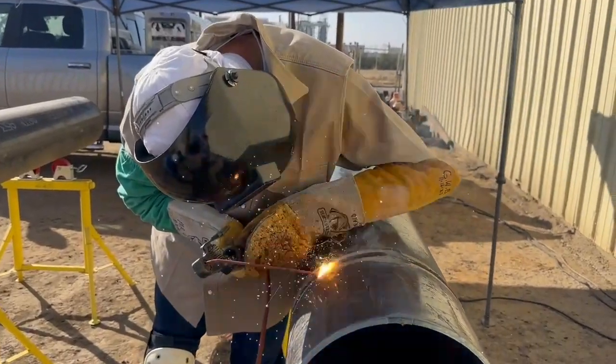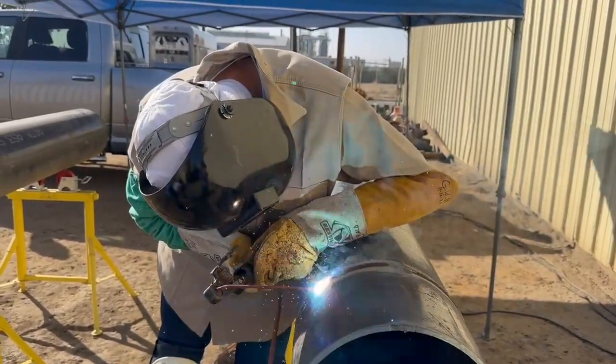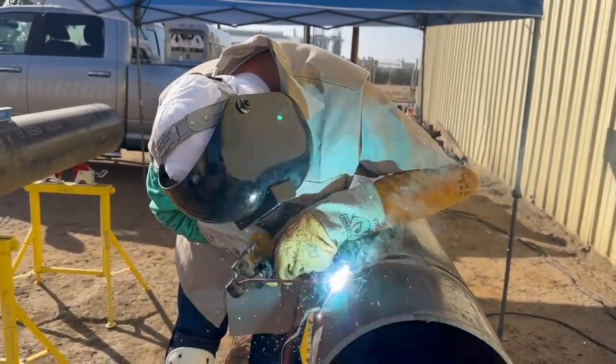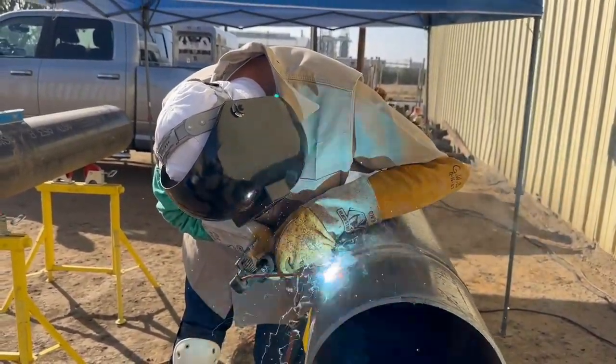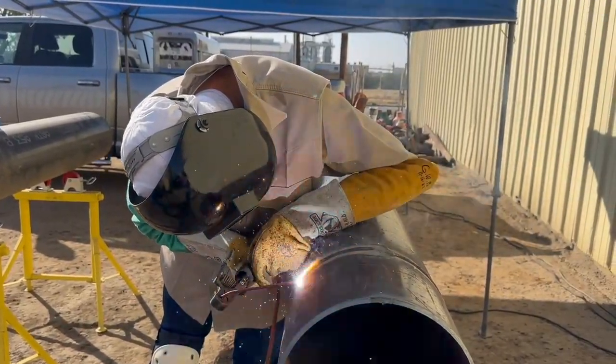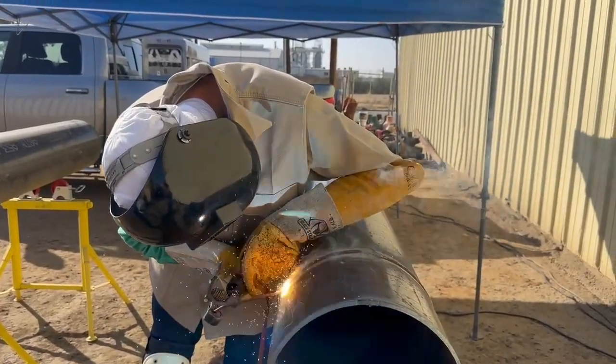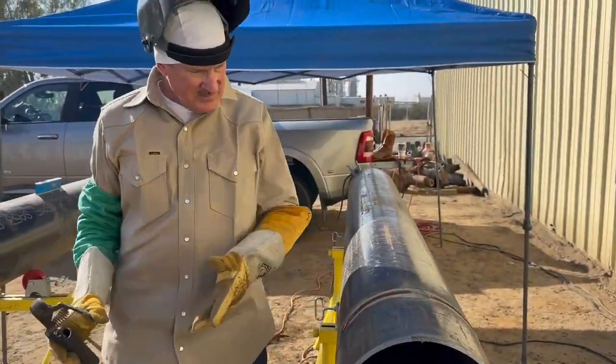The first problem area is on top. People always overfill it because it's flat and it's easy to weld up there — you can see good, so you tend to overfill it. Be conscious of that. Do not overfill it. Do not make the fillers over-full. You want a space up there of about 2 inches to be about a sixteenth low.